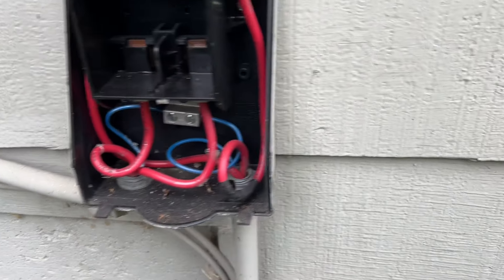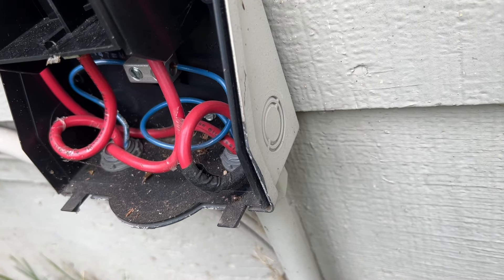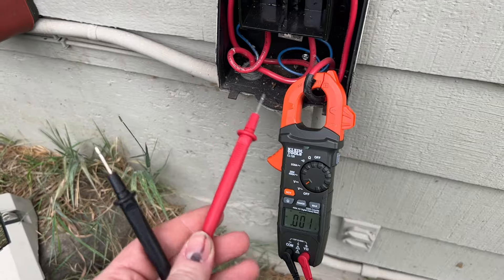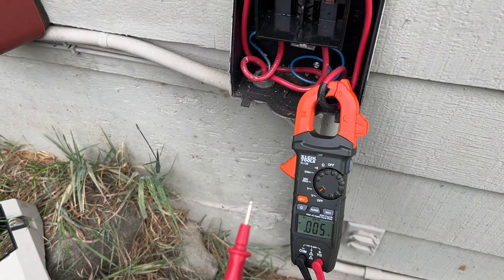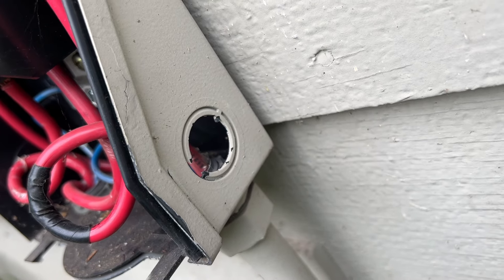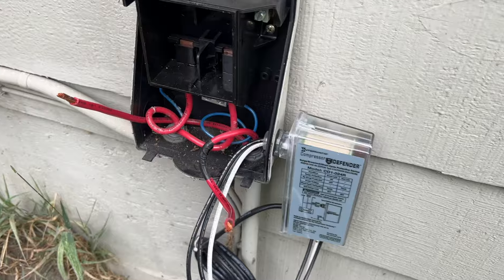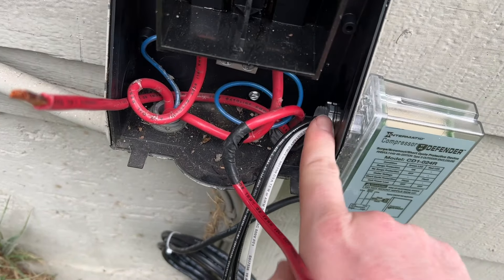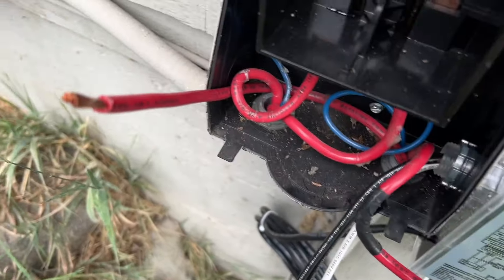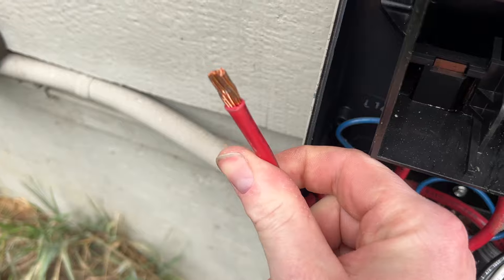So we need to install it on the side here. Now this is a plastic box, so hopefully we have some good luck knocking this out. Just tested to be extra sure we have no power, and we're good. So now we will knock out the side there. The knockout is out — is it perfect? No, but at least the whole outer second one didn't come out too. There it is, installed on the side. The hardest part really was getting the washer or the nut on there. I believe it's supposed to be 10-gauge, but they used 6. I was like, boy, that's big, but back then it wasn't as expensive as it is today.